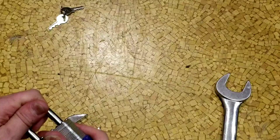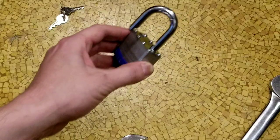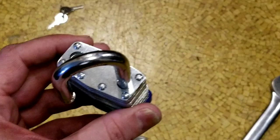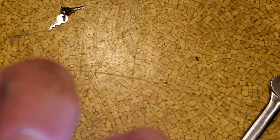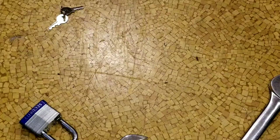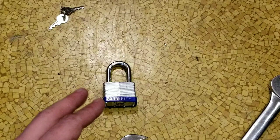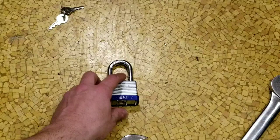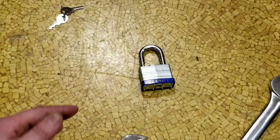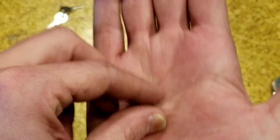There we go — got it. You can see it cut a little half-moon out of that brass locking dog. That should not have happened. If they're cutting out the plate steel — well, they used brass because one issue with Master Locks is when they get older and corroded, they won't open with the key at all; those little sliding dogs get rusted in place. So there was some forethought putting brass in there for corrosion resistance, but it made the locking dogs incredibly weak. Here are the little pieces of brass cut out of the locking dogs.